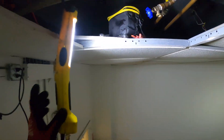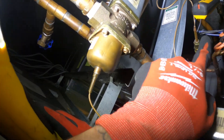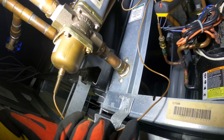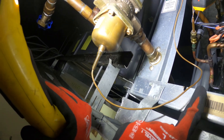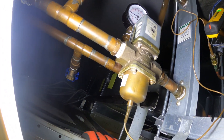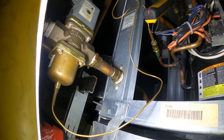So what I was saying is that if we look at this, this is our high side — it's connected to the water regulating valve, so we can't check pressures on the high side, we can only get the low side. Unless there's a whole bunch of work done here — I would put a swivel T so one goes in here and then we can check pressures. Owner doesn't want to spend too much money, so we're going to let it be. Let it run — let's make sure this stays on at least 20 minutes.